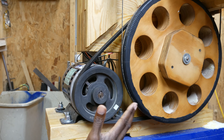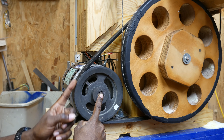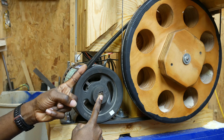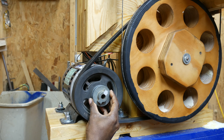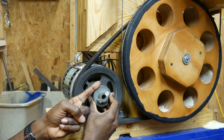Your pulley is a lever. Consider that this is your axis of rotation, and this is where the force is being applied in order to give you different amounts of speed and torque. For the same horsepower rating, if you use a smaller pulley you have to apply more force because your lever is shorter.